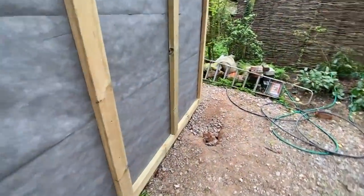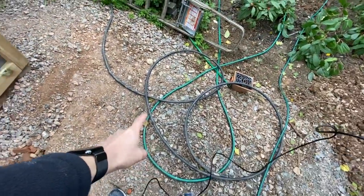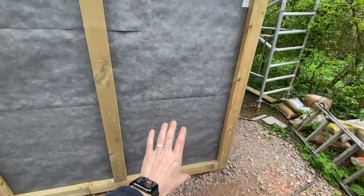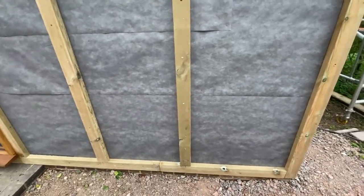We're going to put a distribution board on the outside here. So we're going to put a metal cabinet on the outside. Main supply armoured is here already. Terminate that in, and then a Hager RCBO board in the metal cabinet with an SPD in. And then all the cables will run out from there.